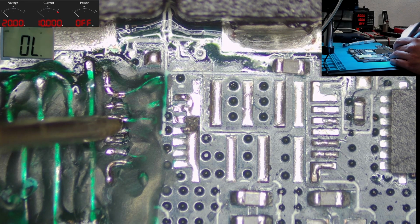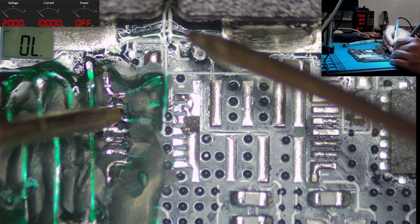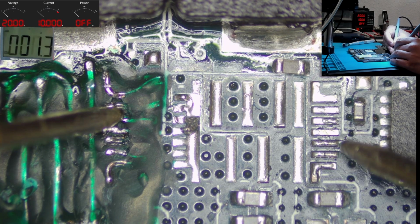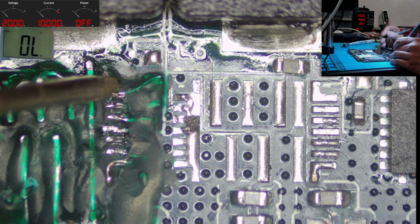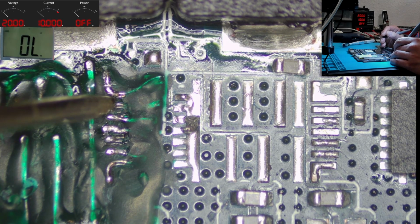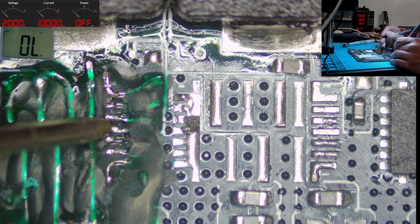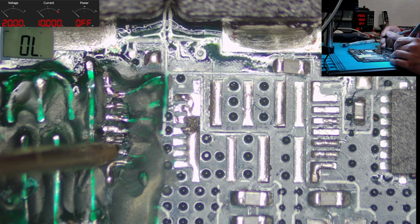And this is ground. Forgot, this is ground. And we do have continuity with ground. Ground is everywhere. Where is ground? Here. Here is ground, and we do have continuity. So, bootstrapping is fine, VCC is fine, current sensing is fine. No, this is ground, sorry. Ground is fine, current sensing is fine, VTemp is fine. Now we have a sync pin.